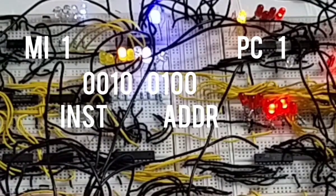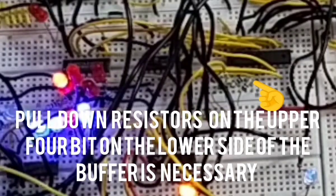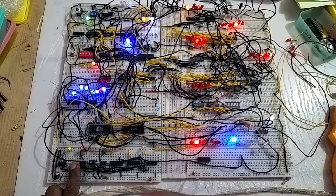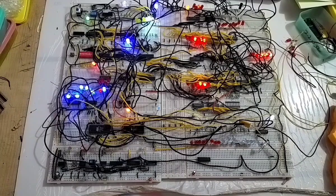That value has been transferred — the Add instruction will add the value into the B register, then the ALU will give the result. So 9 plus 10 — 10 is on location 4 — that data transfers into the instruction register. You can see the transfer into the instruction register. So 10 plus 9 is 19, which is now transferred into the A register.